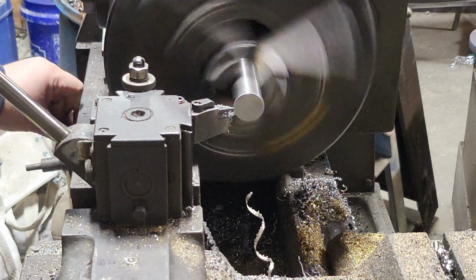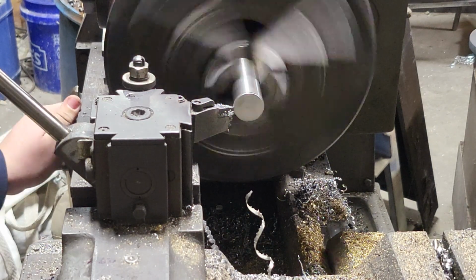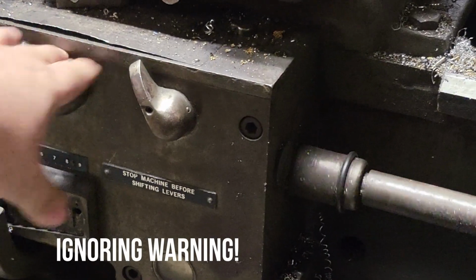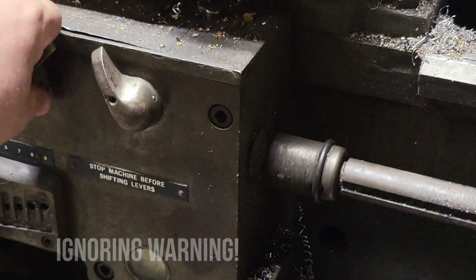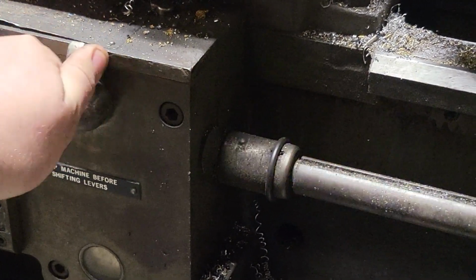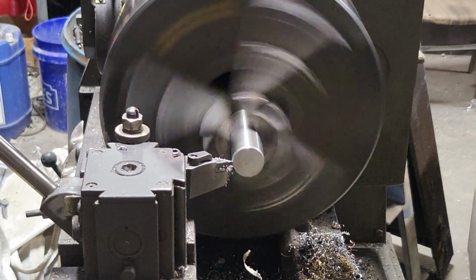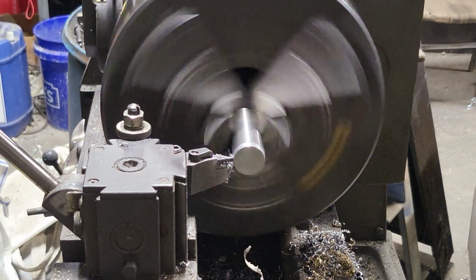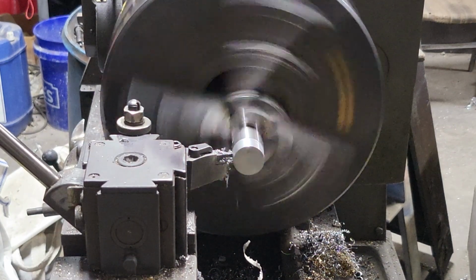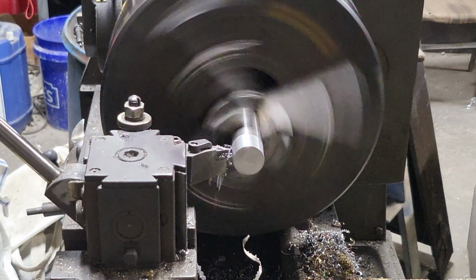Tell you what, for this, I'm going to speed up the roughing process because I don't really care how the finish looks, not until I get further down. Change my feed and speed. Basically, if you look at the relationship of these knobs to this shaft, as I turn these knobs, that shaft changes how fast it moves. So, in this case, I'm going to run it about that speed. For the roughing process, you're mainly just wanting to move material out of the way. You don't really care about the finish. It's the fastest way to get the material off of what you're working on.